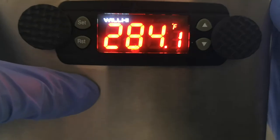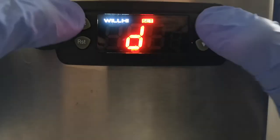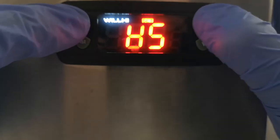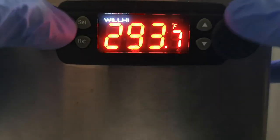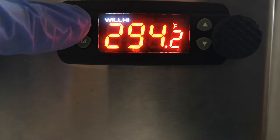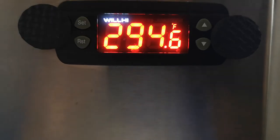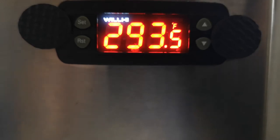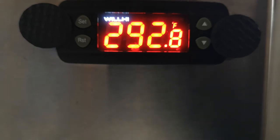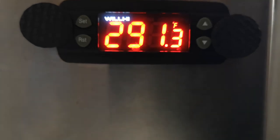You also have to go to HC and set this from C — which is cooling mode, don't know why it has that — to H. Then press reset, check that everything's gone through, and that the delay differential and the P7 timer are set. Hopefully the press plates should stop increasing in temperature and start to go down again. It's worth saying: when you've done this, your minimum and maximum temperature limits will have been wiped out, so it will be set to something like minus 22 Fahrenheit and 530 F.